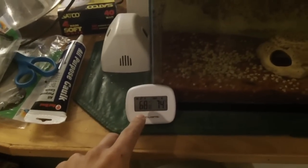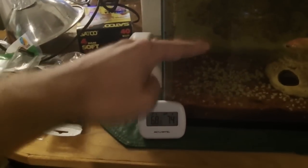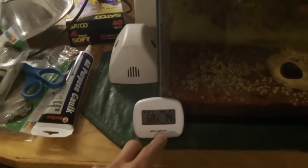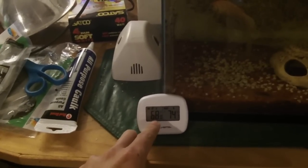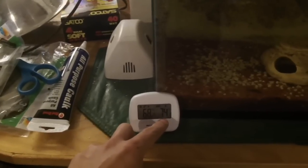What we figured out is that from one thermometer to the other, there's a 0.9 degree difference between the readings. We also found that because of height in the room and heat rising, there's a two-degree difference. So if we take that into account at 9:15 in the morning — 74 minus 68 equals six degrees, minus two for the height difference — we've already started gaining four degrees out of the heater. We're going to keep working through the day and around 12 o'clock I'll come in and do another walk-around test.